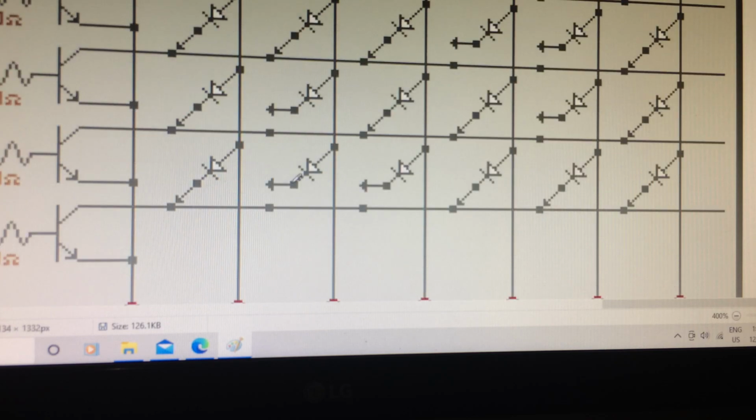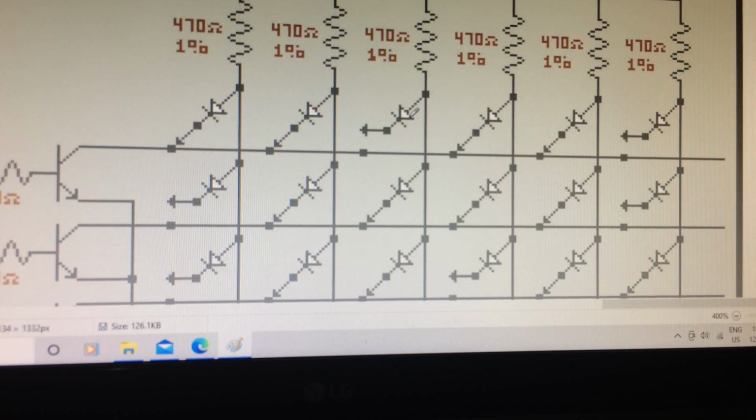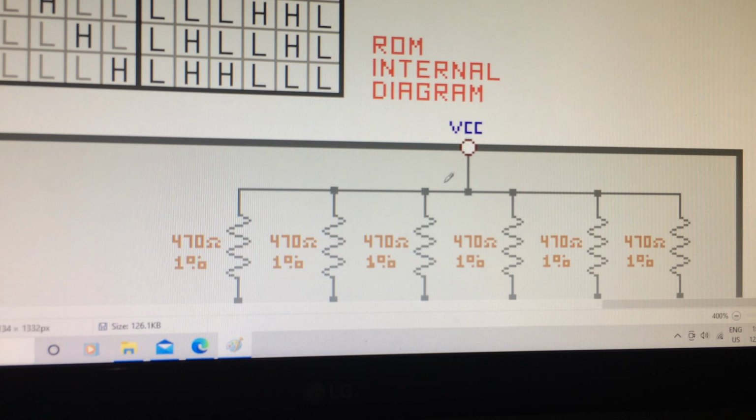And the six bits across in each row is necessary to control the 4066 bilateral switches in order to switch the transistors in the orientation required for it to be tested. And I know that's probably kind of hard to understand, but in my next video, when I continue with this, I'm going to show you exactly what I mean.